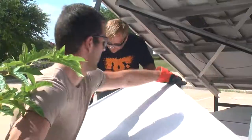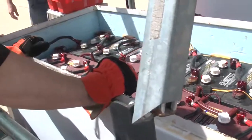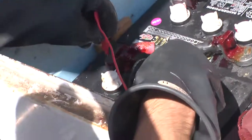Once we get the batteries fully maintained, what they've been doing is normally storing this with the array disconnected from the charge controller. So in other words, when it's sitting out there in their storage facility in the parking lot in the sun, it's not charging the batteries. And given the state of the battery bank right now, that was a good decision because it would result in overcharge of some of the batteries.